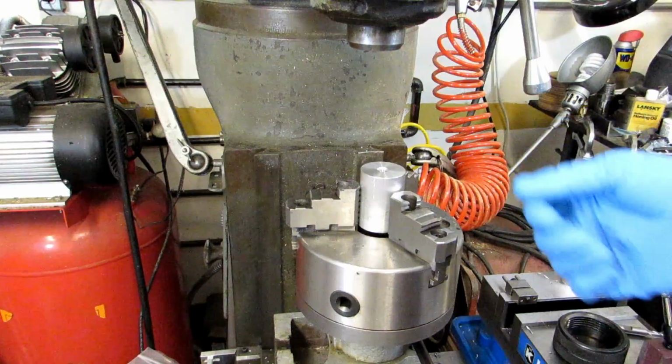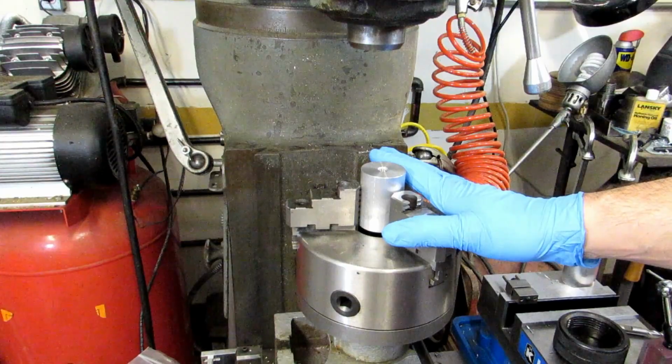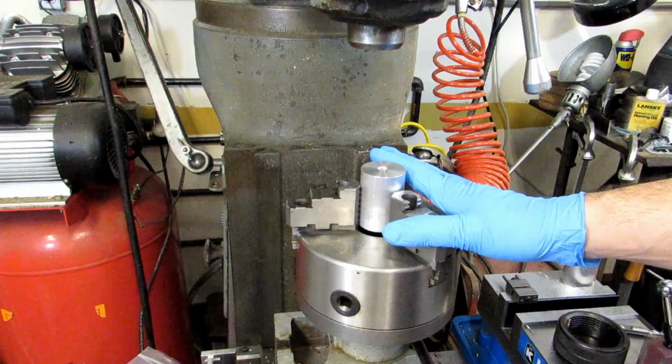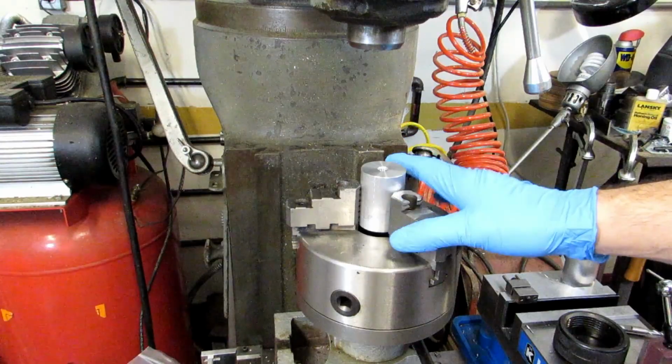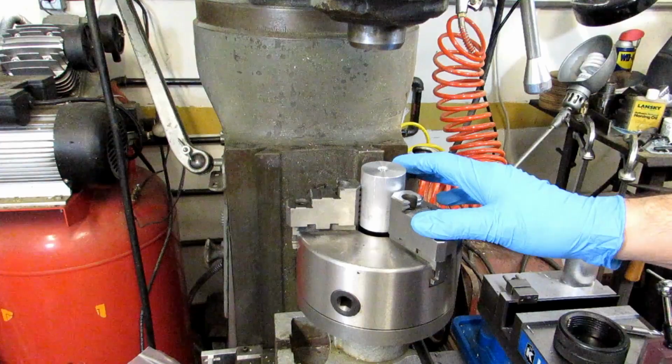That means that wouldn't necessarily be very good for cutting gears, but the vast majority of the time when you're indexing something, you just want to put 2 wrench flats or 6 wrench flats or features that are 90 degrees from each other. So a direct indexer like this actually does the vast majority of the indexing that you might want to do. For doing things like cutting gears or splines or graduated dials or more complex divisions, that's the realm of the dividing head, and that's going to be covered in a future video.